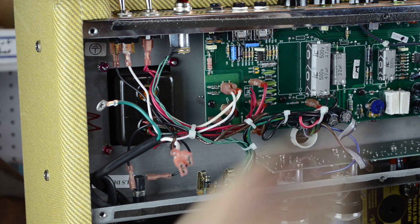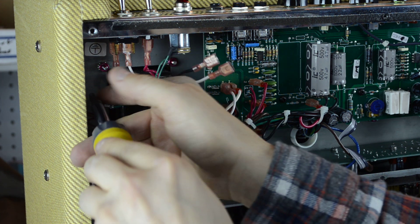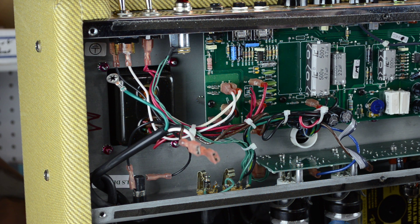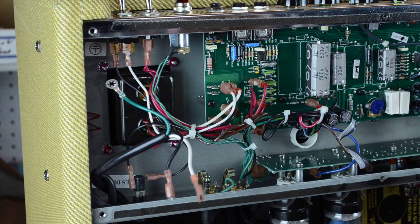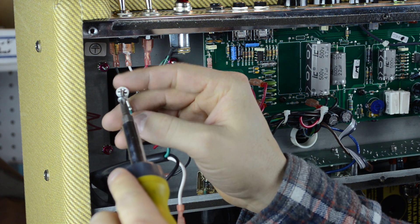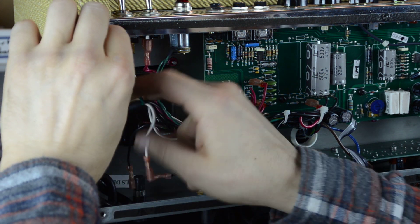Or you could purchase a longer cord — just make sure when you purchase your cord that it's the same gauge. This is 18 gauge, which is actually a pretty lightweight cord; you can get those just about anywhere. If you make it really long you'll want to increase the gauge. Wire gauging is a bit weird — the higher the gauge number, the smaller the wire. So when I say increase the gauge you actually need to buy a lower gauge wire. 12 is larger than 18, so from 18 you'd probably go to something like 14.